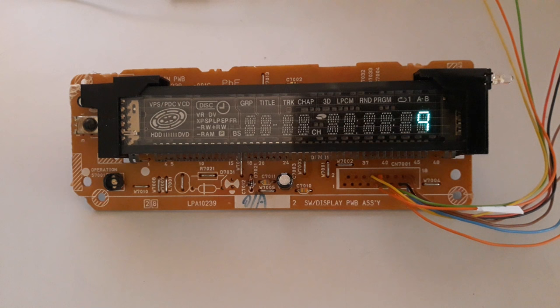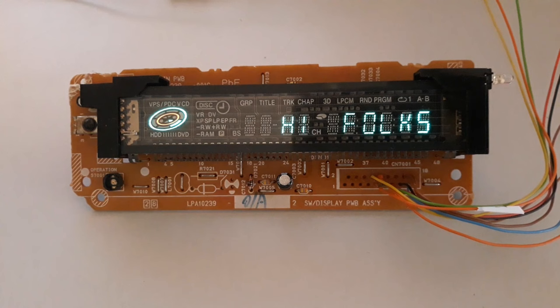We then have two pins destined to the filaments, the driver power supply, which in this case is plus 5 volts DC, and finally the network segments voltage, which I use as minus 24 volts DC. The service manual with the diagram is available on the web and helps with hardware issues. Today we will try to highlight the few lines of code necessary to get the panel working again.